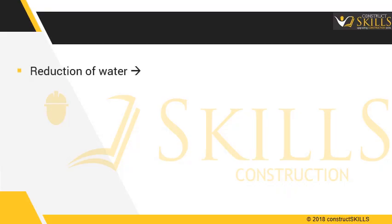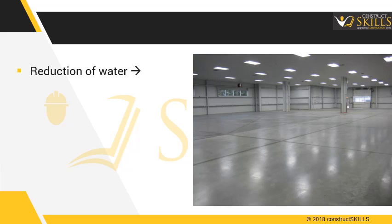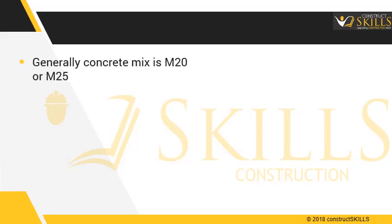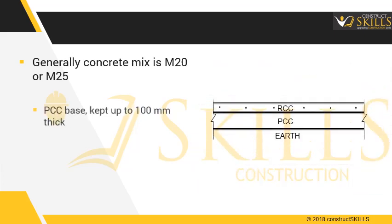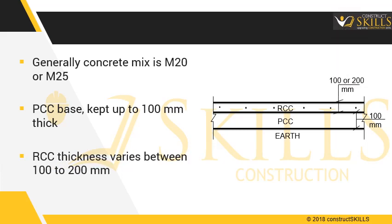Through the reduction of water-cement ratio, especially at top, the compressive strength and density of concrete increases. This provides better wearing and tearing properties of the concrete surface. Generally, the mix of concrete is M20 or M25. The PCC base, below the RCC surface, should be kept up to 100 mm thick. The RCC thickness varies between 100 to 200 mm, depending upon loading required.